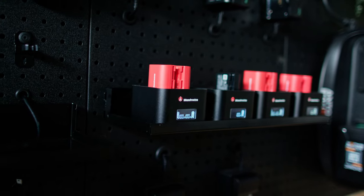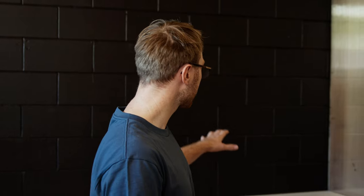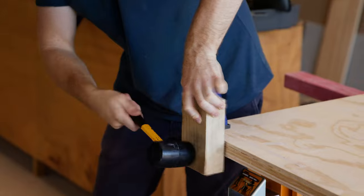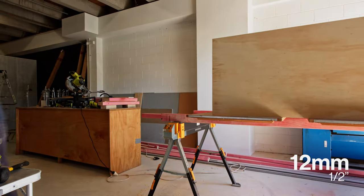While Trace finishes up the drawer dividers, I'm going to create a storage system for the tripods. We're going to do this by creating a wine rack-style system that slots in underneath the bench top — it'll give us quick and easy access so we can get tripods in and out quickly. To match the rest of the gear room we're building it out of plywood. Rather than taking the easy option of a gridded cubbyhole system, we're going for a lattice design.